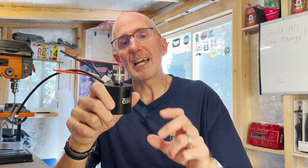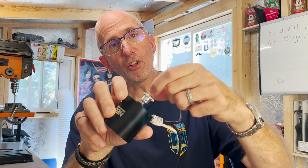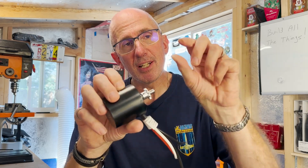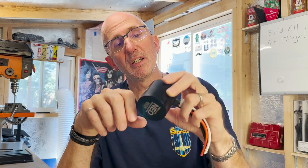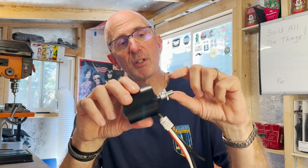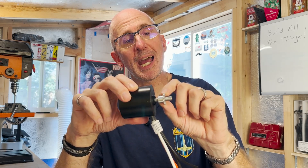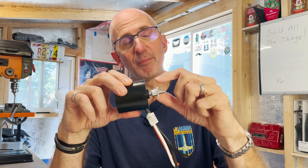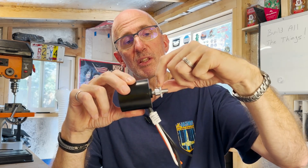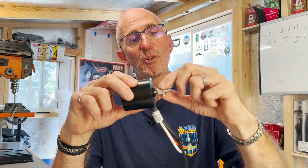For the motor you will need to add a gear. The motor shaft has a little slot in it called the key way. You can get the Neo motors and all these parts from Rev Robotics — there are two different companies, Vex and Rev, that I buy these robotic parts from. This little gear I had to drill a hole and tap it for a set screw. Then you put the key in and slide the gear over the top, and with the new hole that goes down against the key, it holds that gear in place.